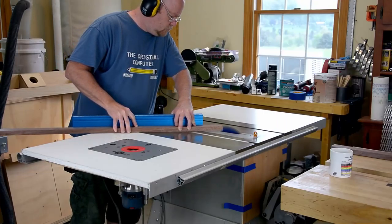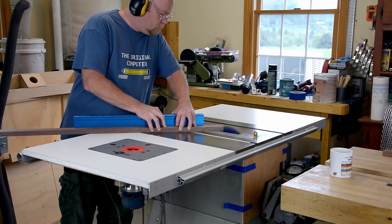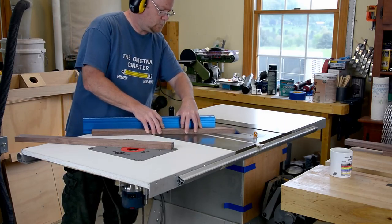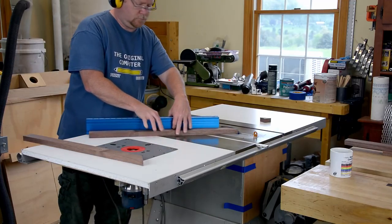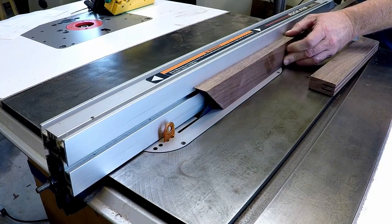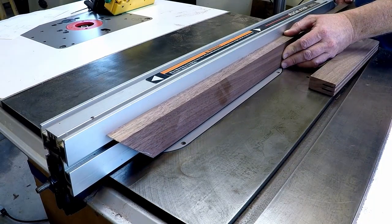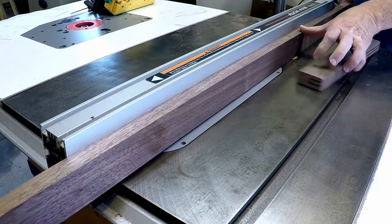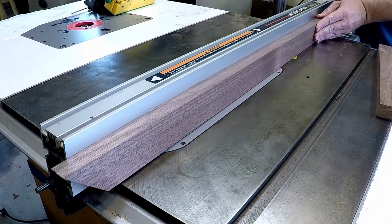The last frame to be constructed for this project is the top frame of the cage, and it's another mitered construction — exactly the same as the doors. Mill the stock, cut the ends, shoot them square, and use one as a template to cut the rest to length. After the rails are made, they need slots for the expanded aluminum to slide back and forth in. This is actually a pretty tough process — it's hard to hold the material tight against the fence and tight down against the table. I didn't get it in one shot; I had to take a couple of passes to get the thing to full depth.